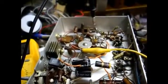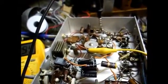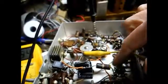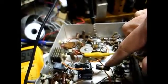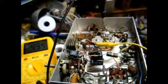Now let me mention one thing concerning resistors. Over the years I've had people ask me about a burning resistor in their radio. Well, I need a 470 ohm resistor. Mine keeps burning up. Well, just a little service hint. Anytime a resistor overheats, there's something causing it to burn up. Resistors just don't overheat and burn on their own. When a resistor burns, there's something that's drawing too much current through the resistor, which is exceeding its rating and causing it to burn up. So when you encounter a resistor in a piece of equipment that's overheating, you don't just replace the resistor unless you like smoking resistors unnecessarily. You need to find out what's causing the problem, and the way you do that is how we just demonstrated with the ohm meter. Look for an abnormally low resistance to ground, and then once you find it, correct the problem and then replace the resistor.